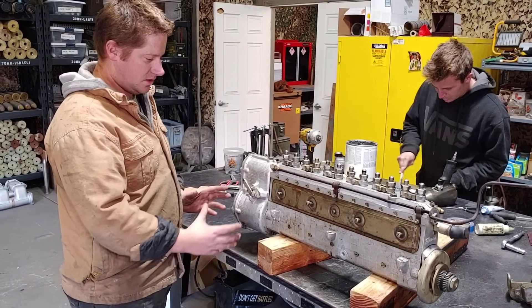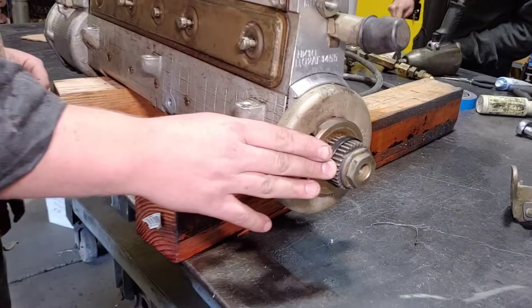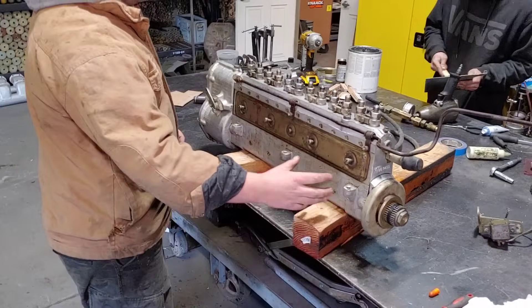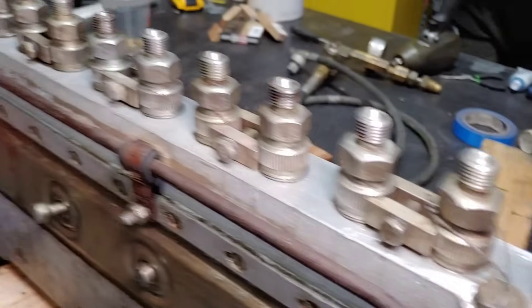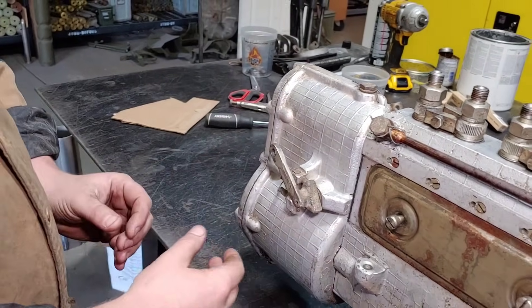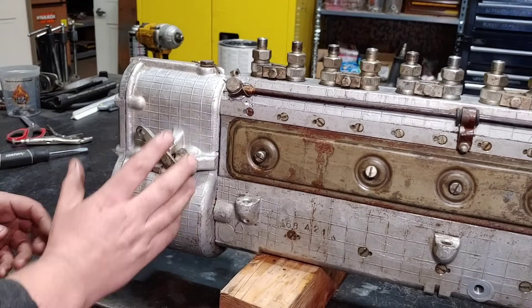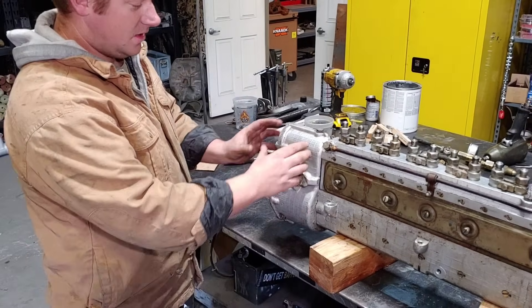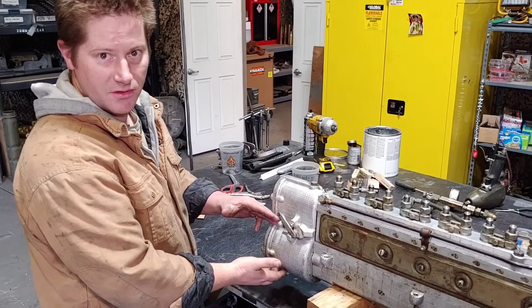Just a few of the components. This section here — the spline — is actually tied into the air start system on that side of the engine, as you've seen in previous videos. All your fuel points are up here for the top. This side of the pump is the accelerator actuating. There's a plunger down the bottom and a feed arm which goes under this plate. This section is oil-filled — filled with oil to assist all the mechanical components — it's not part of the engine, it's a separate oil sump.